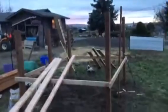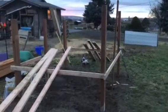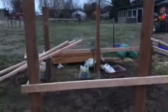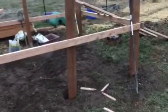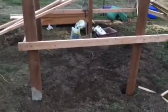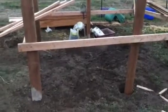The barn is coming along — it's a little donkey shed. I've got almost five posts in. I'm going to put a two-by-six up here in the front because I'm building half a wall on this side, making that the door for winter. In summer I can just take it off and let them have an open sunshade spot. All the posts are sunk about three feet in the ground — I used my Southland auger, filled them in with gravel and a little cement in the bottom, mixed some quick-set cement along the way, then dirt on top, built a little hill to have the water drain away from it.